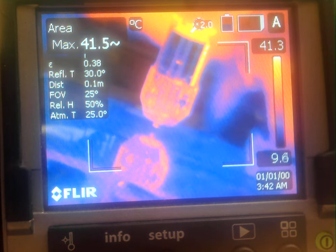This is run number three of depositing 0.6 millimeter sterling silver onto aluminum oxide at 30,000 RPM and a surface speed rate of 75 millimeters per minute. We are moving a total of 10 millimeters on the table surface, and we are moving the Z-height 0.125 millimeters throughout the course of the deposition — that's down towards the substrate.